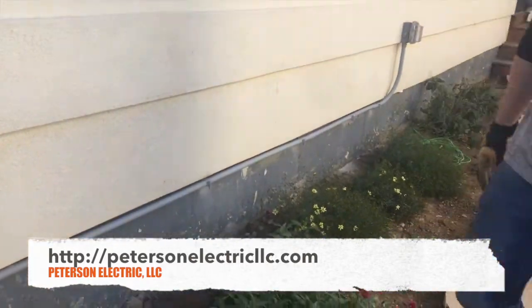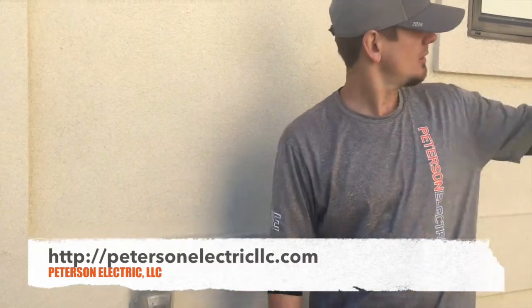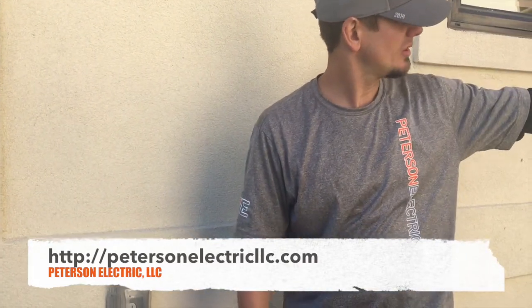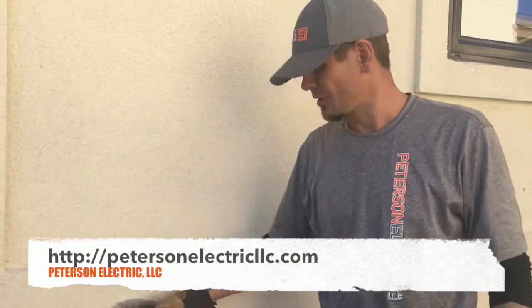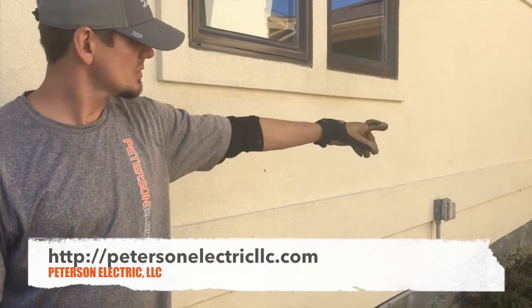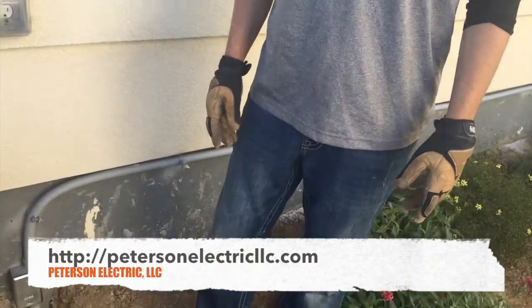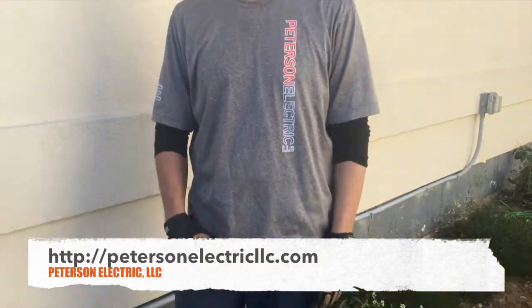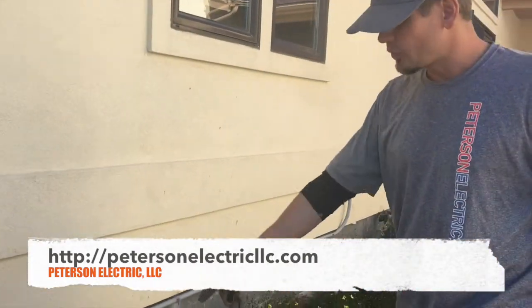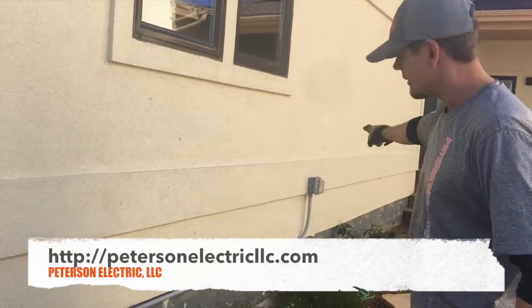You might be wondering why I didn't just put an extension ring here. The problem is this outlet jumps over to the corner, to the basement, to the front of the yard — it was completely dedicated for the courtyard, originally part of one of the pumps. So we decided to come in at the back side of the job. They didn't want to retrench anything because it was already done, so we told them we'd find a way to adapt from two-inch to three-quarter, put in a junction box, bend it, and bring it up.